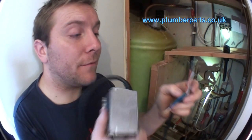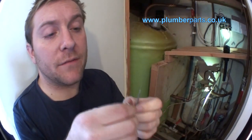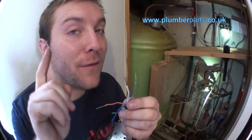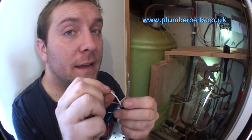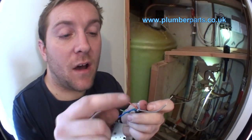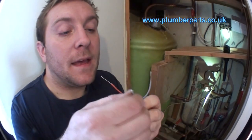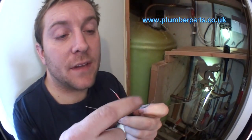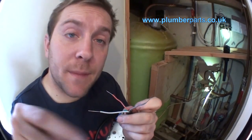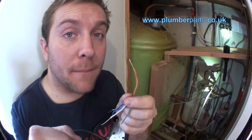With a three-port valve, it's a bit different. You've got your live, your neutral and your earth, and then you have two lives here. These get livened up according to what services you're looking for, and they also move the motor around. Say your white is your hot water and your gray is your heating — the white livens up, the motor moves around, and then it switches the live that goes through the white, through the motor, and then back out on this orange, off to the boiler and the pump. Similarly, it works in exactly the same way for the heating system. The heating system comes on, it gets signaled by the programmer, it goes through the thermostat of the room, comes back, switches down here, opens the valve, the valve makes, and then it livens up back down here, off to your boiler and your pump to tell them to come on.